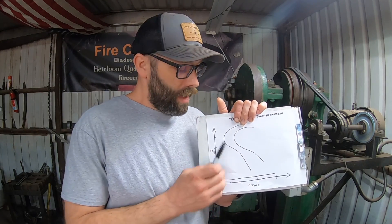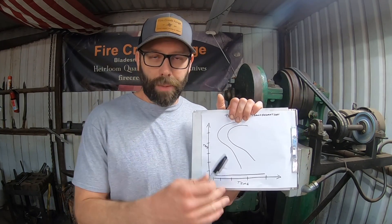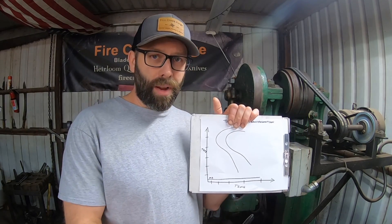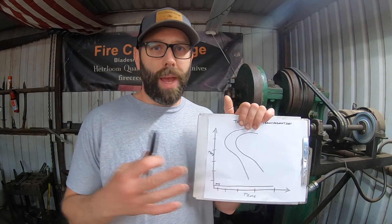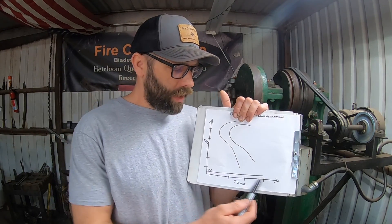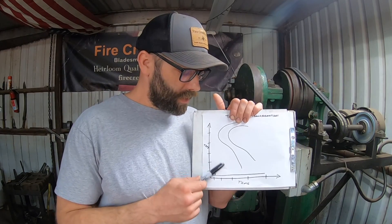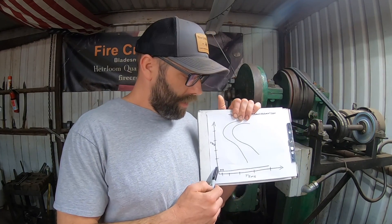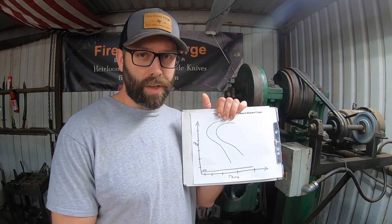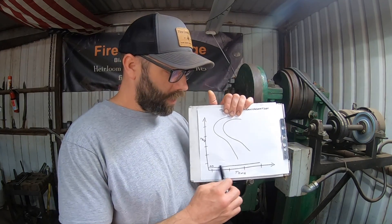That slow cooling is not going to affect the hardness of your steel whatsoever — what matters is missing that pearlite nose. One caveat: any martensite forming in the blade may be auto-tempered from residual heat, but practically that's not an issue since you'll be tempering higher than that anyway. Down on the diagram there's the Ms line — the martensite start line. You're not actually creating any martensite until the temperature gets down to that Ms region, and the martensite finish is often so low in temperature it may not even appear on the diagram.